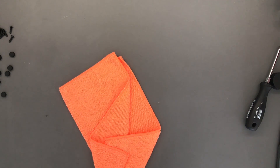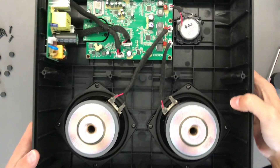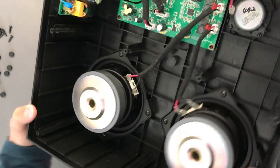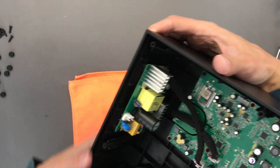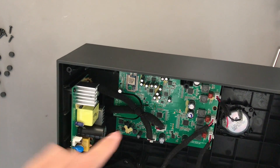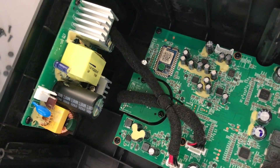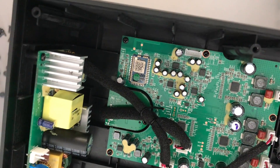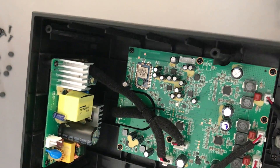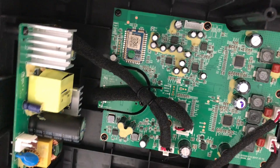I can't turn it up too loud here because the walls are made of cardboard. The speaker has a fairly barren design but the drivers themselves look quite nice. There's a little power supply, a tweeter amplifier board, and two amp chips. The Bluetooth board we'll peel off and check. The encoder is on a separate board, mechanically isolated from the main board — so if that fails you can replace just that. It's routed from the same PCB, which is quite elegant.